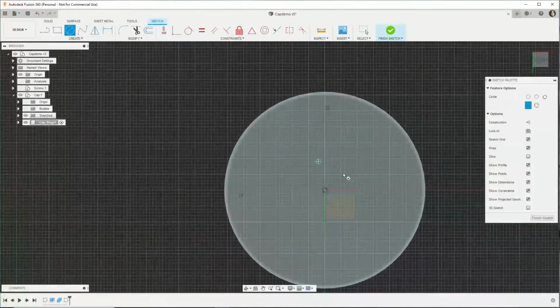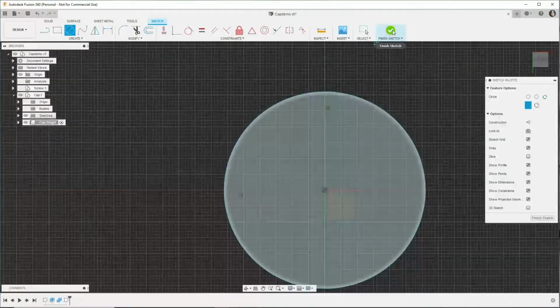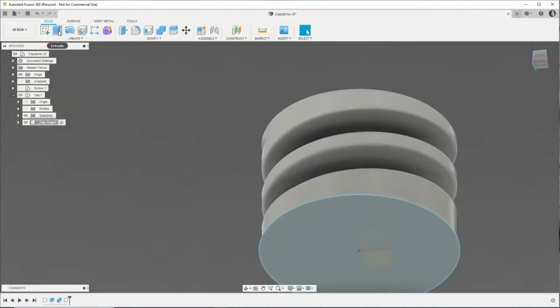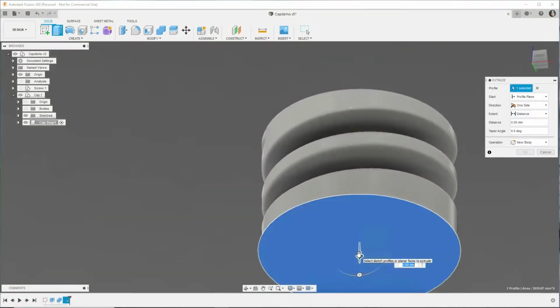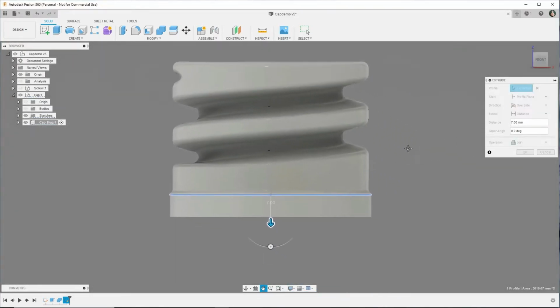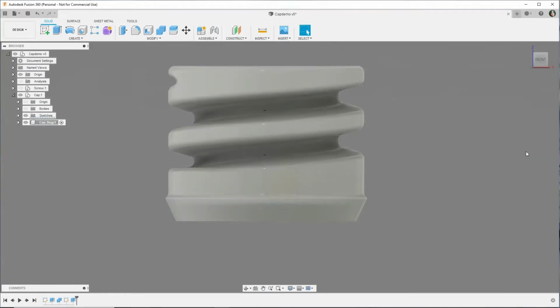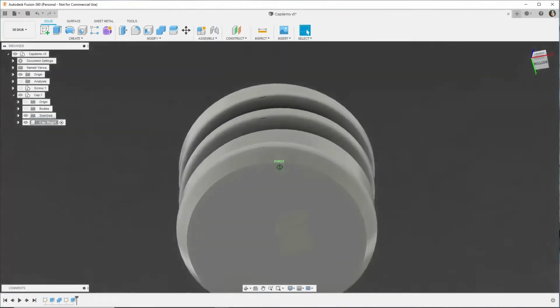So we're going to make this little bevel, which is really important when we're going to register all the pieces into the mold. So what we do is we extrude a little bit, put a little bit of a draft angle on it, and that's going to sit into the bottom piece of the mold. So all the little bits will line up together. It'll make a little bit more sense in a second.